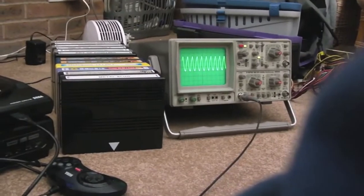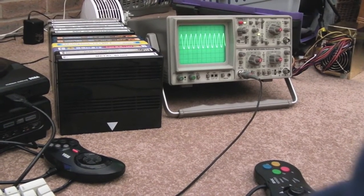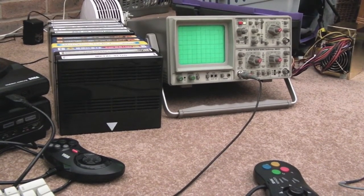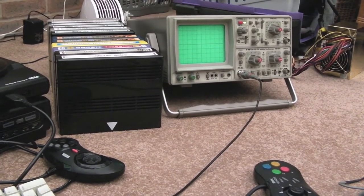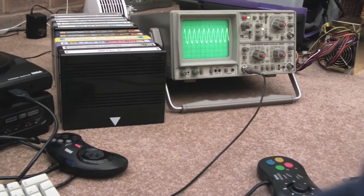But if I show you on the scope again, sorry, can you see that's looking like 16 megahertz? You can compare, if you look at the gap there, the time space or whatever, and I compare to where I'm getting the 8 megahertz from. You can see that's the 8 megahertz. The amplitude's a bit higher than the 8 megahertz, definitely. It's not a very clean, it's not a sine wave, I don't know, something else is generating that, I guess, somewhere on the board. But back to the 16 megahertz.